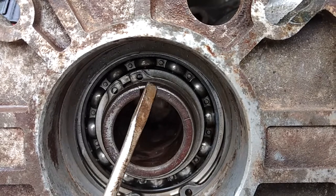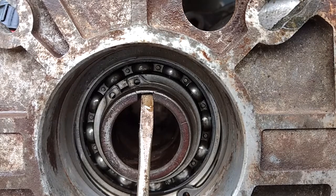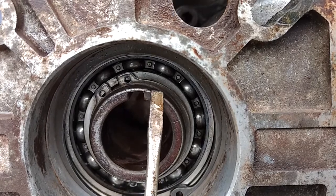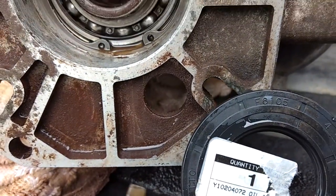You can see carefully right around here on either side of the keyway is a crack. So when the engine is on the load and it flexes this area of the shaft, it creates a sharp edge there and prematurely wears whatever seal you put in there.